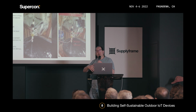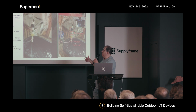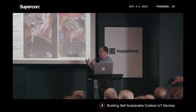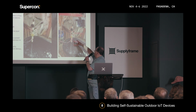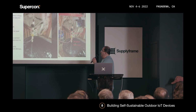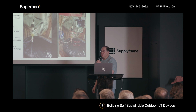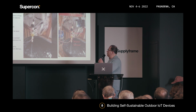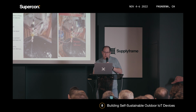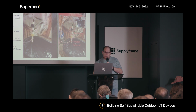So I thought, well, why don't I use that same principle with the water turbines? So I added another water turbine, and we have here, sorry about the sound, it's difficult to get used to this. So you have the two turbines there, and then the water sensor connected to the same pipeline of water. And voila, I got 5 volts out of it, constant voltage, but the current went up to 138 milliamps. But unfortunately, I thought I got it, and I hope that the video works.